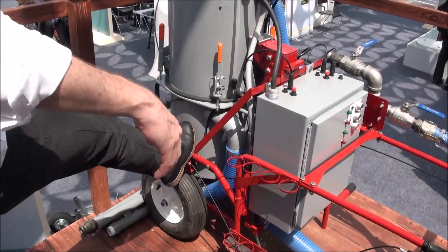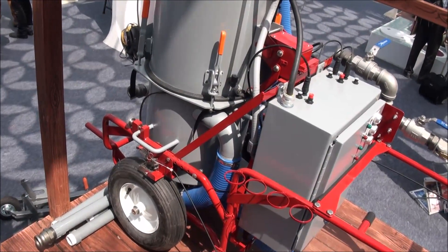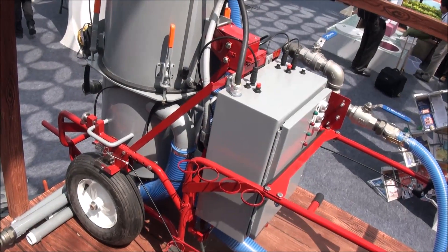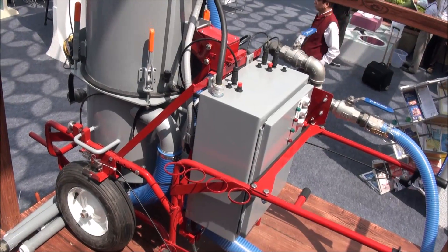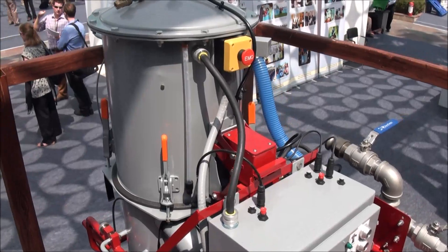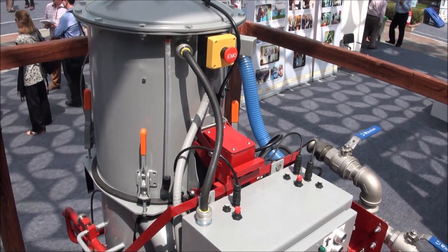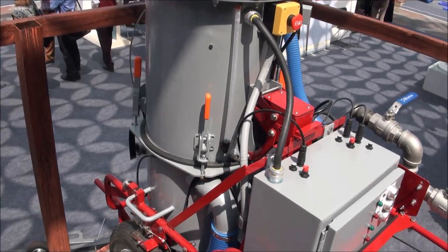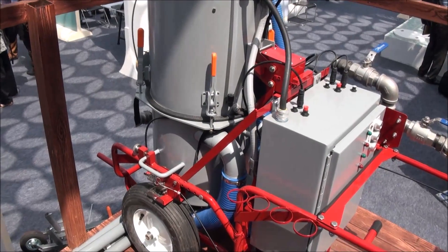In this drum we capture all the heavies — the rocks, glass, metal — they're caught in there, and when it fills up we drain the tank. It's just the solids in there, the trash, and then we pump chlorine in and sanitize it, and then you can dump it out and start over again. The throughput volume is 50 gallons per minute, so about 3 liters per second.